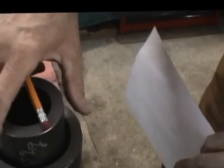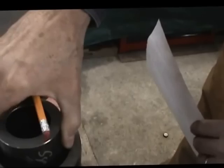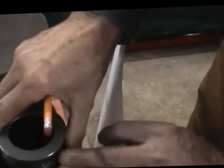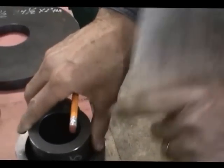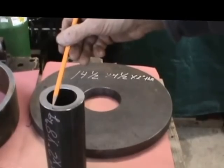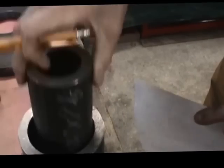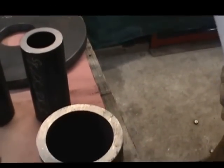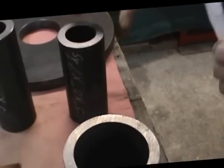And what we do is we put in a dummy shaft, which is a little bigger than the original shaft that's going in it, which would be that one. This one will stay pretty much the original size, and then he'll turn down the one that's going to be welded in there to 10 to 14 thousandths smaller than this shaft here. That way we have a little clearance between the shaft and the babbitt, so it will ride smoothly and turn nicely on that.